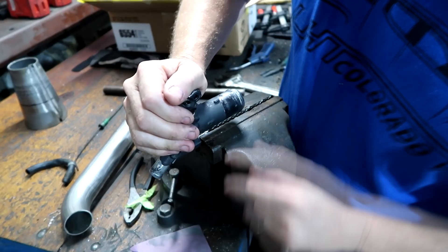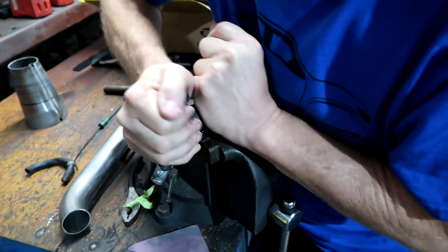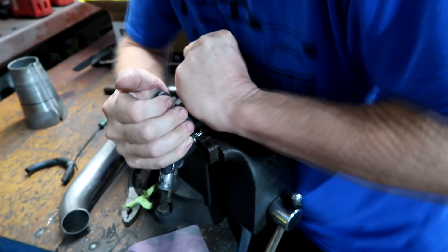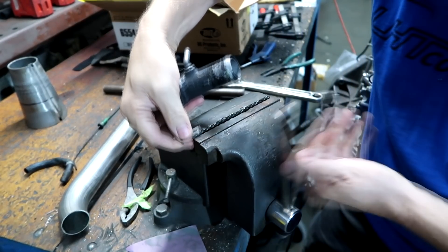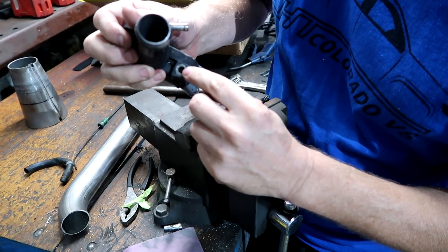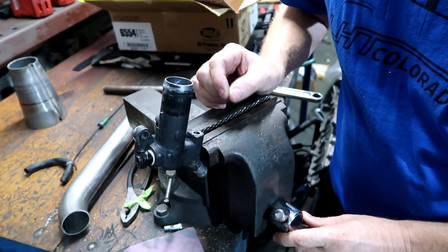Don't pinch this thing flat, but put a little bit of force on it and see if you can twist it back and forth and see if it'll move in there. Sometimes it will. Worst case, if for some reason it gives you all kinds of issues and you can't get it out, cut it off flush, run a drill in there and remove just the steel portion - you want to get back to the aluminum, remove the steel, and then you can weld it up again. There he goes - heard it click, it moved in the housing. It's moving. Now we're down to straight aluminum. I can weld that. We're going to remove that paint first, so let me hit this with a wire brush and clean on the inside so as we weld it doesn't get contaminated.